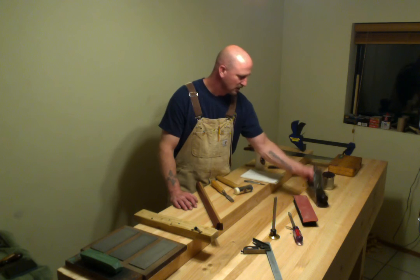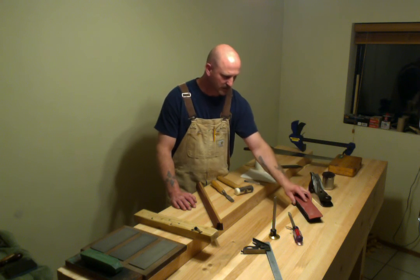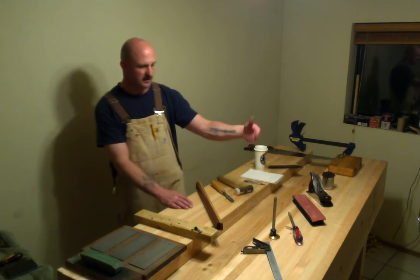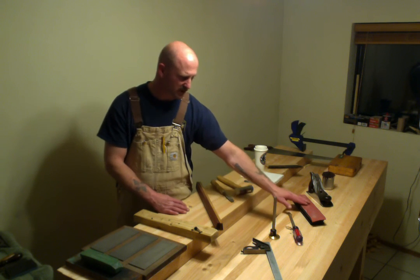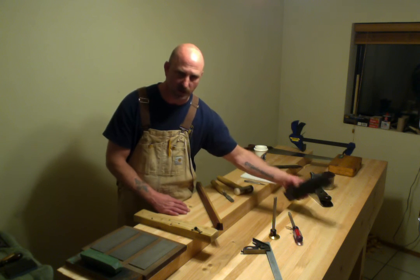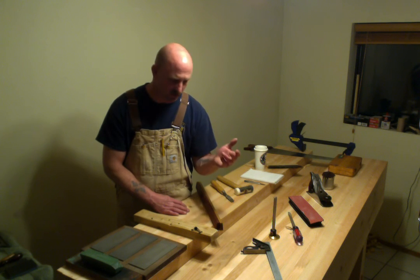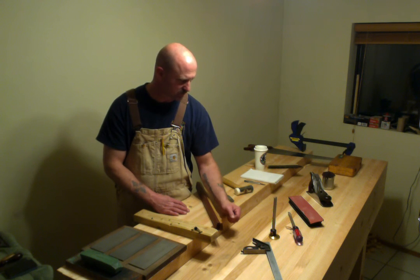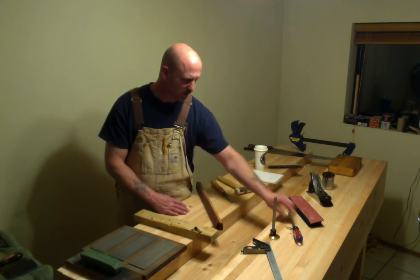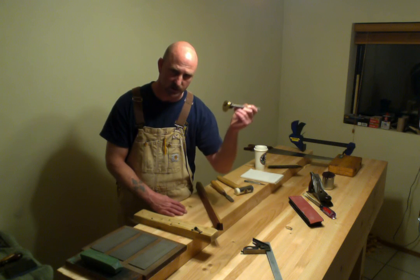Lubrication, one plane, something to finish with, this or a scraper. I'll choose this because you can just replace it and get a nice fresh blade or a fresh cutting surface, and it's cheaper than, and you could just use a block of wood and some sandpaper. It's cheaper and takes less know-how than a scraper. Got to take your plane irons out somehow. Got to mark everything.